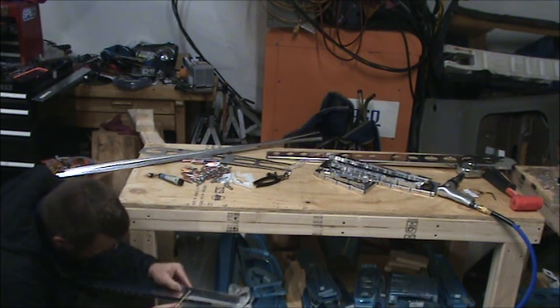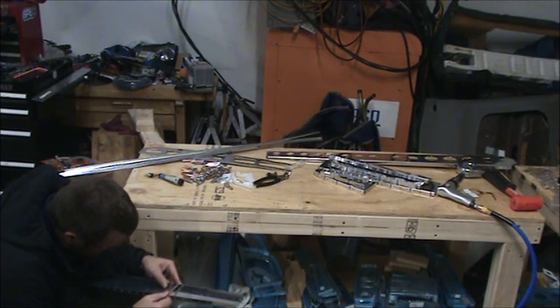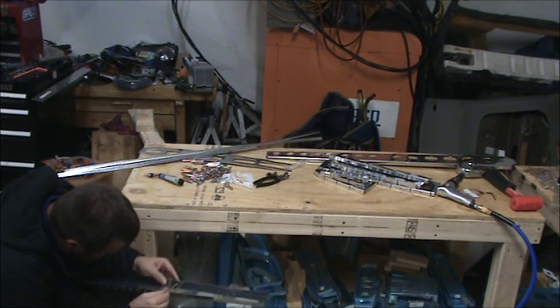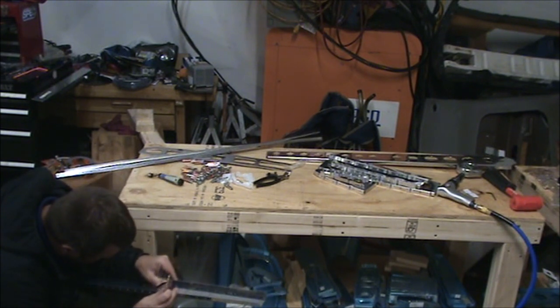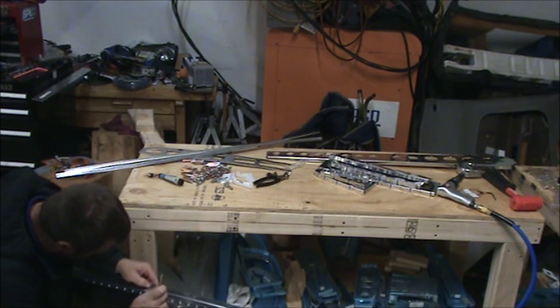Any of those countersunk holes. That's pretty nice. Now I guess if there was and you need to take it off, I would go with a Scotch-Brite pad or something else, or a 3M wheel, rather than the drill bit, because the drill bit's going to snag on that real thin metal there from the countersink being cut out and just really mess up that hole.